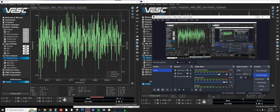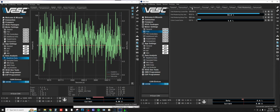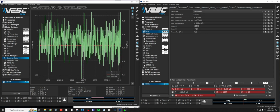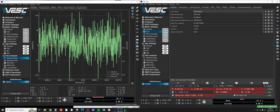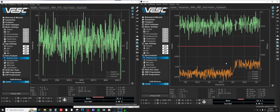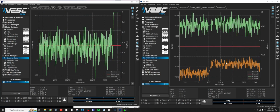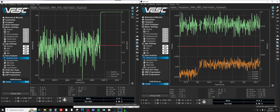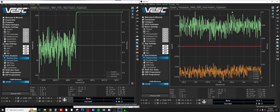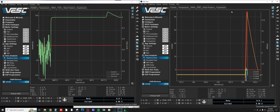All right, I think I'm going to try a couple quick tests with this side set up running sensorless. So let's set this sensorless and click save. And I think this might be potentially beneficial for our weird D-axis current control issue. So that's a sensorless start, like just some light throttle. It seems to be okay.